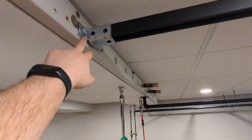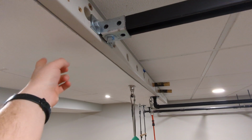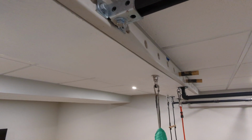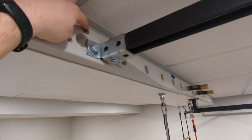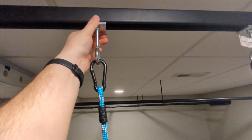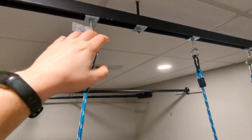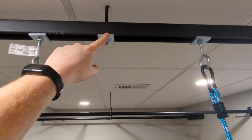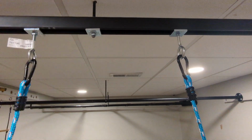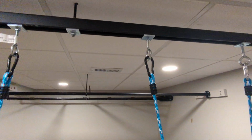So these hangers, this bolt actually goes through this 2x4 and into the soffit here. That's a 2x4 soffit, and these anchors are very deep as well. So this is very strong and robust. These washers are all part of the Unistrut system. I did put a bar or a hanger in this one here as well. If I were to do this again, I probably would have taken another piece of Unistrut above the ceiling all the way down. But that's what's holding that up.